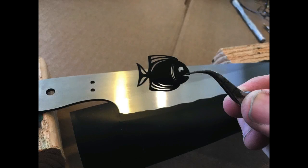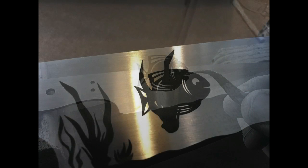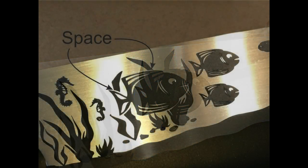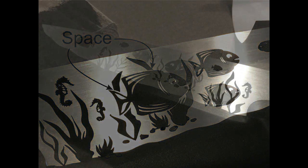With any type of etching, you have to use a resist. I'm using a self-adhesive vinyl, which I cut out on a vinyl cutting machine. What I'm going to do is lay one object over another and try to create some depth. To do this, I have to cut a space between the two objects so that the object in the foreground is well defined when the background gets etched.